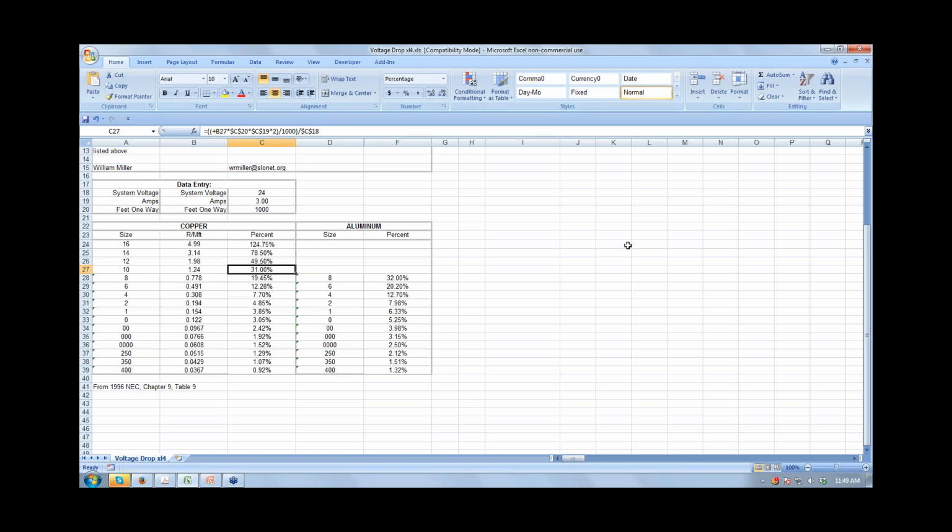But then you're saying this is pre DC to DC converter, right? Yes. Okay. So the DC to DC converter is bumping it back up. All right, yeah, I guess that works. That's a heck of a wire run for low voltage DC. But yeah, if this was on the PV side, that would be catastrophic right there.